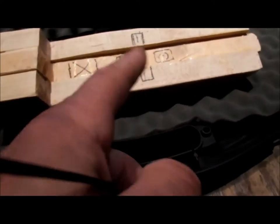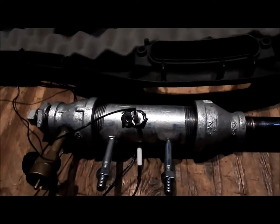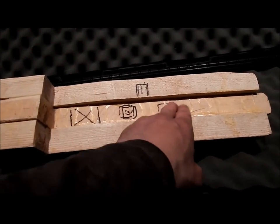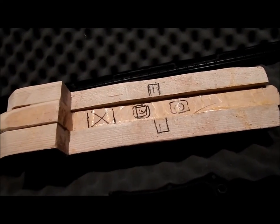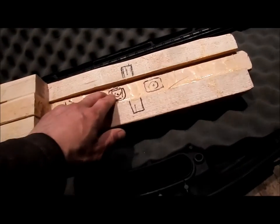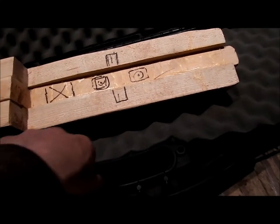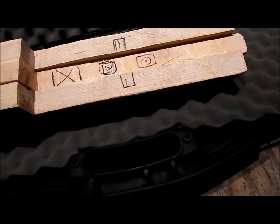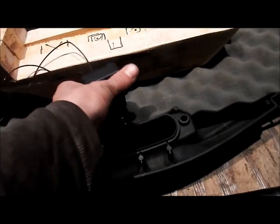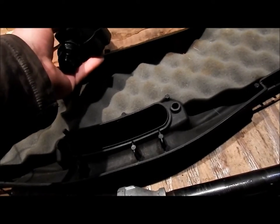I've still got to, of course, mill it. I've just got it marked out. And our gas line. So we're going to basically drill out our holes to fit everything, and then after that we will mill out this whole inside section and make a deep channel so I can lay my wire and stuff in there. And then I'll put two little holes through the side and notch it out and fasten my igniter on the side of here, and that's going to be my trigger.